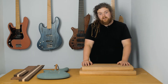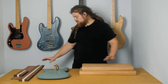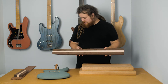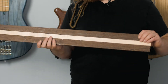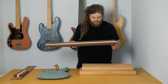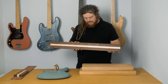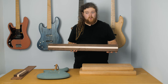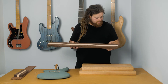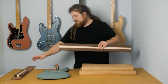To go alongside that, I'm going to do a three-piece neck of wenge and maple, which I've got here. As you can see I've started to join it together and I've started cutting the scarf joint, although it's still very rough. Still quite a lot of work to go in on this before it's ready to start carving or anything, but overall I really like the combination of the wenge and the maple. I think it'll add a good harmonic content and a really nice aesthetic three-piece neck — I'm really happy with that.